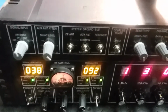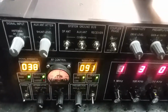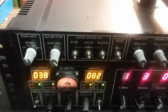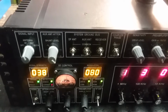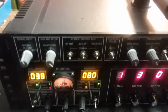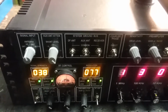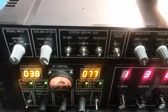Now, the technical part, when you're playing around with proximity loops and things like that, don't forget, you have a receiver that's plugged in, probably with a 3-wire cord. It's going to the house ground system. The chassis on your receiver or your transceiver is cold to ground. It's grounded through the AC line. And you probably got the coax going to your antenna, and that's grounded somewhere out in the yard, isn't it? Maybe the 2 are bonded together, like at my house. I have the TV, telephone, and the power service all bonded together, all the grounds tied together. That keeps lightning differentials down to nothing, hopefully.